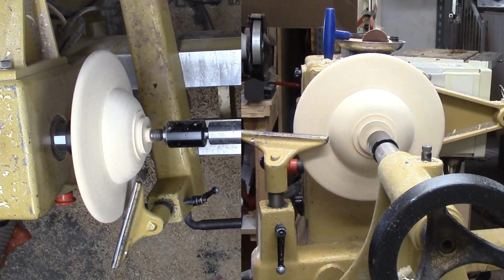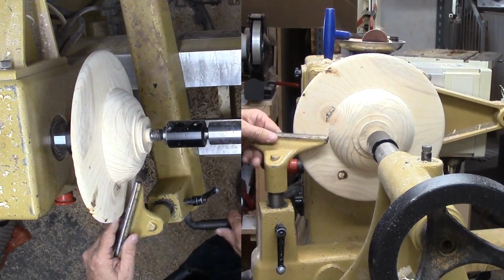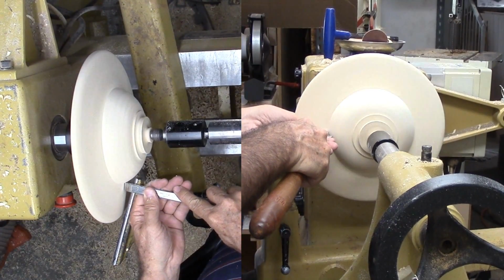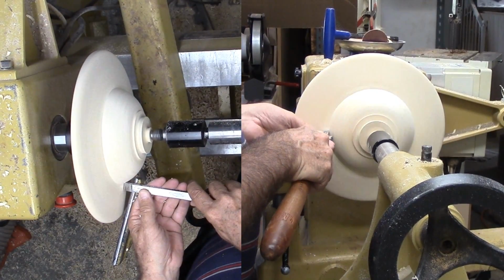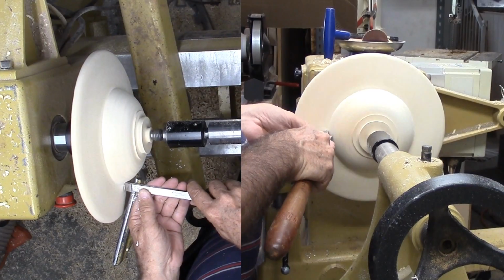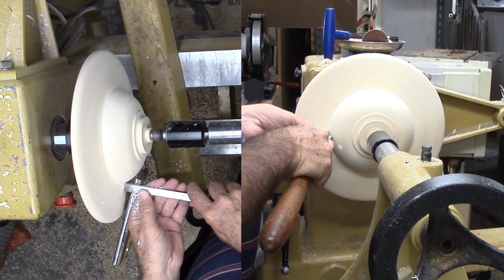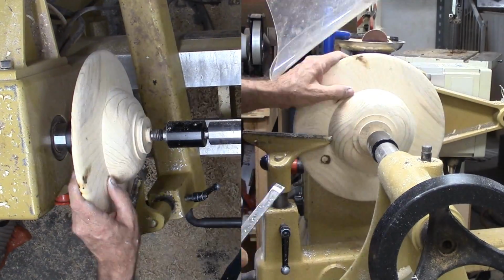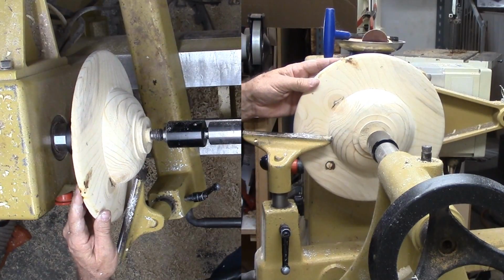Now I'm back at the lathe to turn down the solder to be even with the wood's surface. But as soon as I turn on the lathe, the edge solder piece flies off and hits the far wall. Oh well, I'll try to even off the solder at the knot. I'm using my skew as a scraper. I'm hesitant to turn up the speed, but I am finally able to get the solder down to flush with the wood's surface.